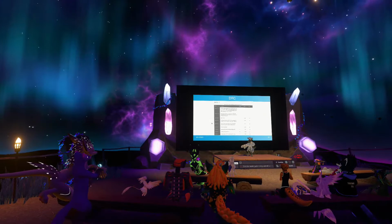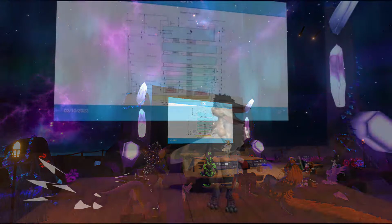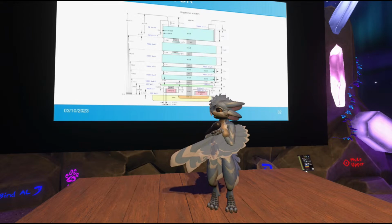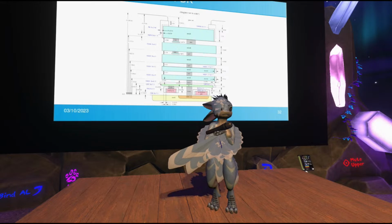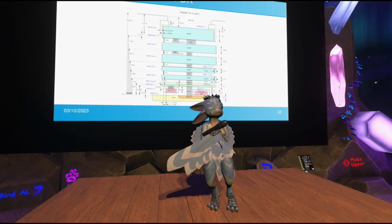So basically, this is the layer stack diagram for the SkyWater 130 nanometer process development kit, where you can see all the different metal layers up top, which is where the routing happens. You can see definitions of the vias, and at the very bottom you have where the actual transistors are. So much of a chip is actually just routing. And of course, you see all these different measures of how large or how tall these different features can be. And this is still a simplified diagram of what's actually going on.